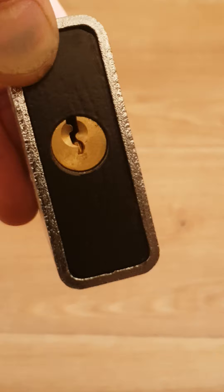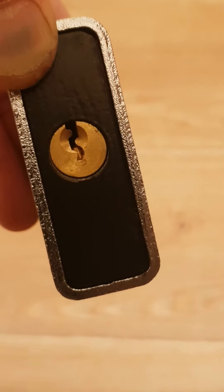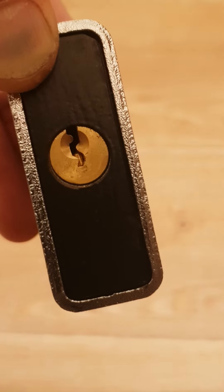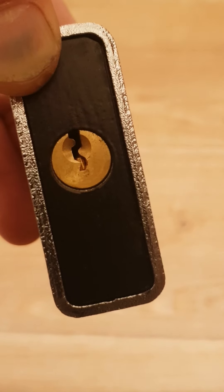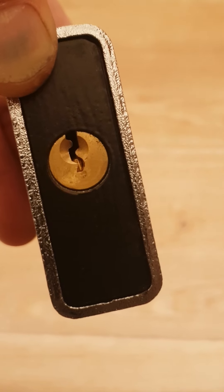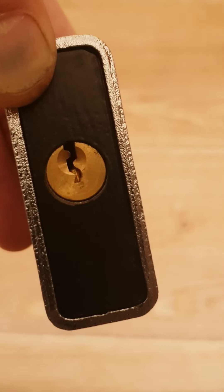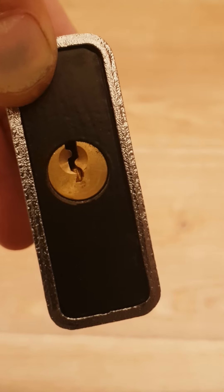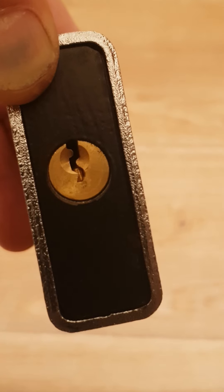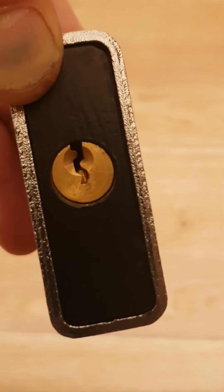Pins will set, and the lock will open. However, this will only happen if I rotate the shackle bar in the right orientation. Conversely, if I rotate the shackle bar 90 degrees, I cannot get this lock to pick open. In effect, the cam, the ball, and the shackle are causing enough strain on the cylinder that prevents it from opening.